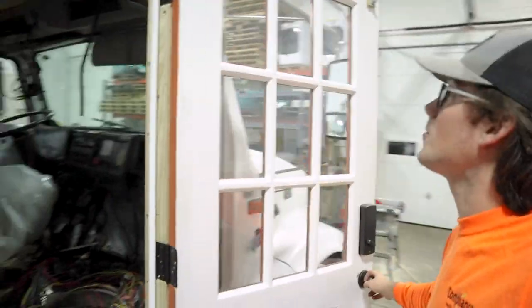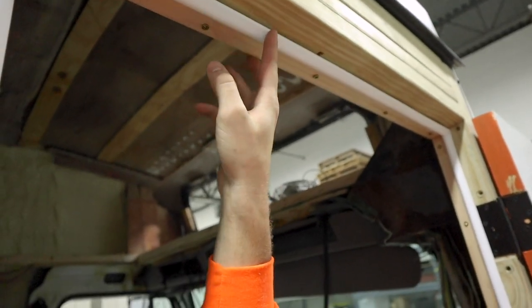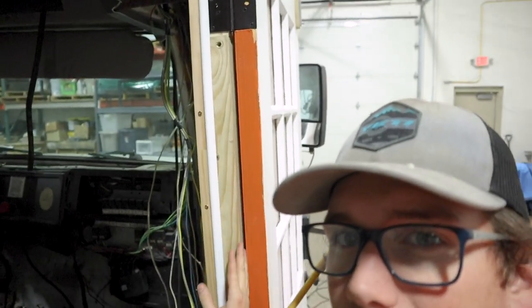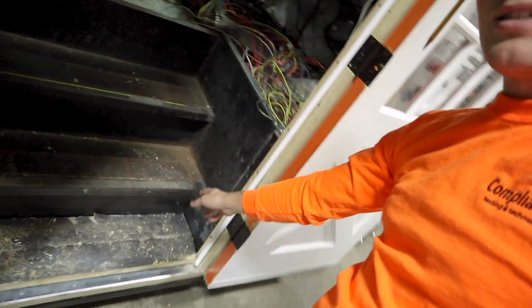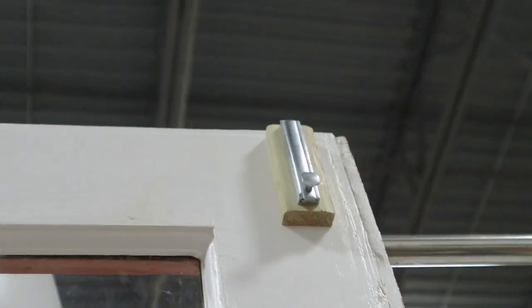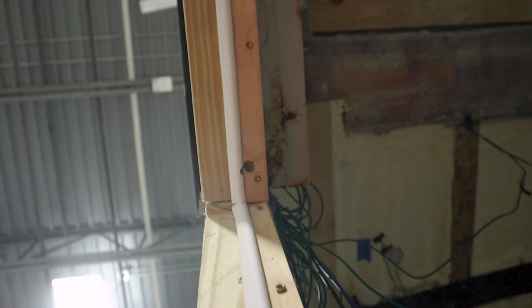Alright guys, just like that the door is done. Let me show you the final touches — it opens and closes nice and snug. We put our threshold in with weather stripping on the front, compressed to close off that gap snugly, and the same on the other side. The bottom is sealed with the threshold and the weather stripping piece on the bottom of the door. The last thing I added is a little slide bolt on the inside — I made a small hole for it. I may need to tweak it a little to get it working exactly right.